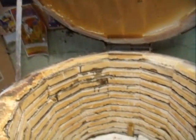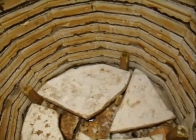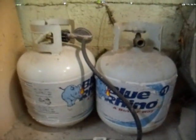This is my ghetto kiln. I'm firing an electric reduction in this kiln. What we have going on here is a standard electric kiln, but I've gone ahead and cut two one-and-a-quarter inch holes in the bottom of the kiln. Underneath those I have standard Bunsen burners — the same kind used back in science class. Those Bunsen burners are hooked to a little 25-pound propane tank.